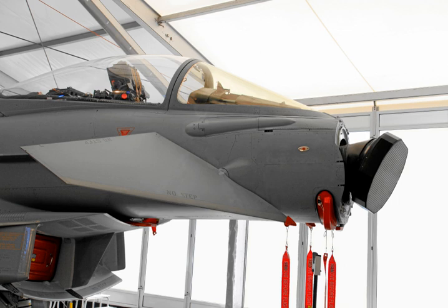Unlike the PESA, where the signal is generated at single frequencies by a small number of transmitters, in the AESA each module generates and radiates its own independent signal. This allows the AESA to produce numerous simultaneous sub-beams that it can recognize due to different frequencies, and actively track a much larger number of targets. AESAs can also produce beams that consist of many different frequencies at once, using post-processing of the combined signal from a number of TRMs to re-create a display as if there was a single powerful beam being sent. However, this means that the noise present in each frequency is also received and added.